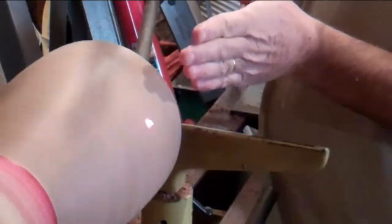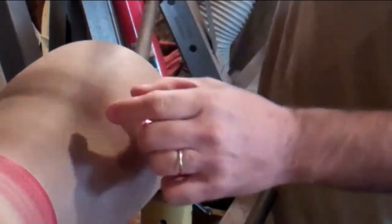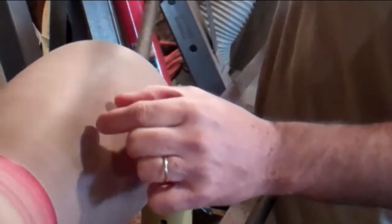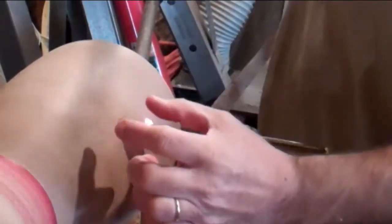Okay, I'm about as deep as I can get here, because as I cut over here, then all of a sudden my next spot's going to be, because what I do is in stages. I do an inch or two at a time, and then work my way down, all the way down until it gets smooth on the inside. It gives you more support at the base. In case you do get a catch or something like that, it's not going to break it apart. I want to keep it in stages to give it all the support I can as I work myself down.